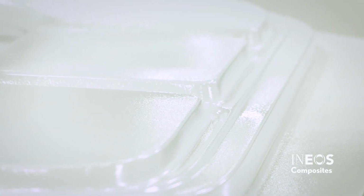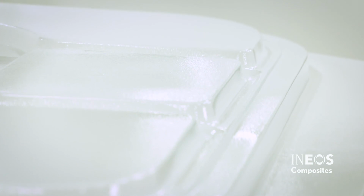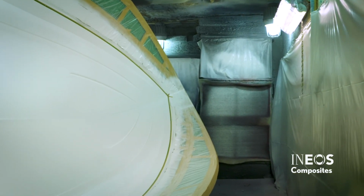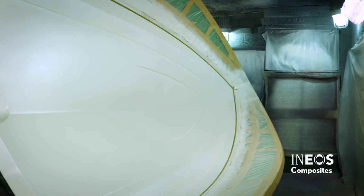Ensure there is adequate airflow across the mold so styrene vapors cannot lay in deep areas. Styrene vapor is heavier than air and will inhibit the cure. Always check the part prior to lamination to ensure that all areas are well cured and dry to the touch.